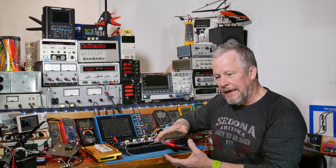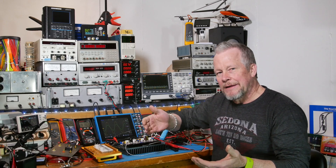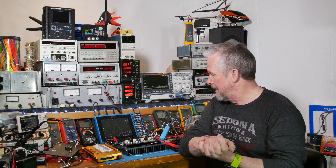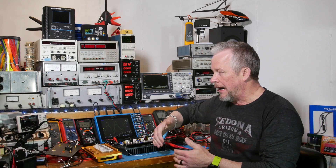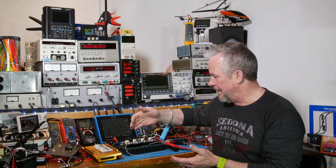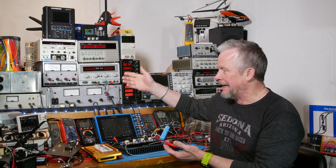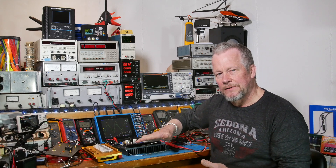After that I said, okay, we've got to have at least this much bias current — which means it's not going to be fully Class A. It's going to be Class A for a certain number of watts, and then Class AB for the rest. I brought the bias current up after that to see how high I could get it, and I picked a target temperature of about 50°C. I wanted it a bit lower, but I wanted to get the bias current up, and I got it right around half an amp. That's right about where this guy settles at 50°C.